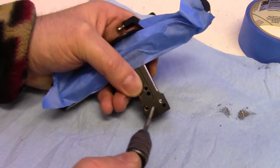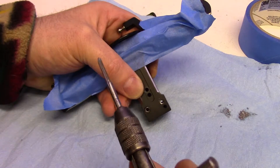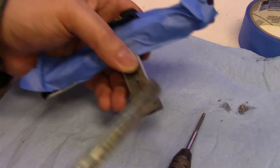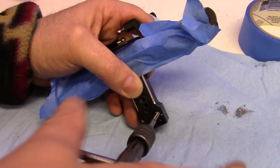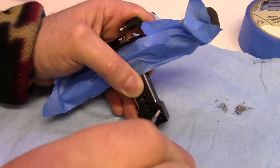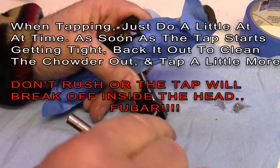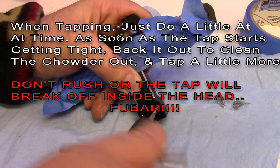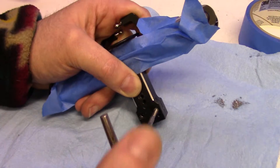I'm just going to stop it now and get the tap out. I'm going to try to hand tap it out. This is an M3 by 0.5 tap. I'll put a little oil in there. I'm kind of hoping that the remainder of that bolt still in there will actually start coming out with the tap — it's a kind of a tall ask, but that would be ideal. I'll just fast forward through this.